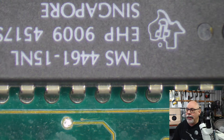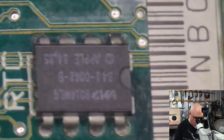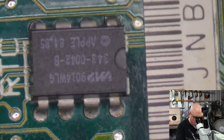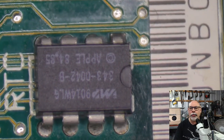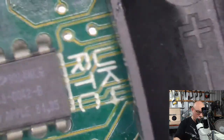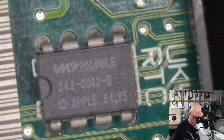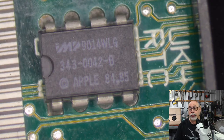Okay, here we go. But yeah, when opportunities come up for these chips, I'll tell you, this is an interesting one. I had someone talking to me about this just yesterday. This little guy here. This is a real-time clock chip. It's upside down. And these fail. And of course, once they fail, your computer won't keep time properly when you switch it off and stuff like that. Sometimes won't even keep time properly while it's powered on.